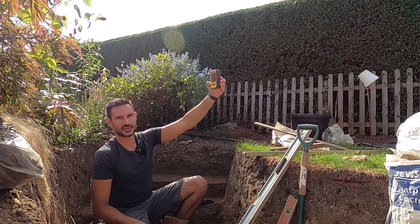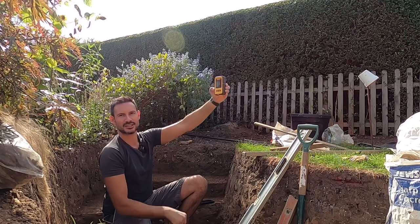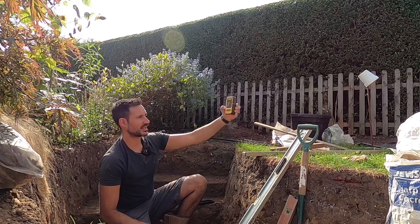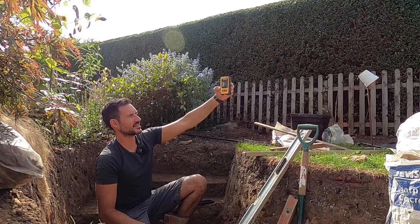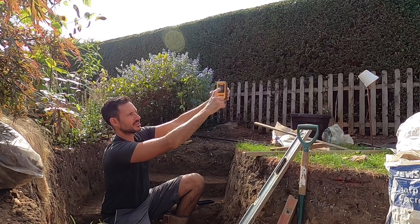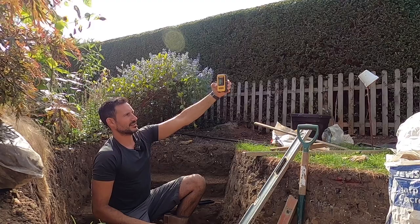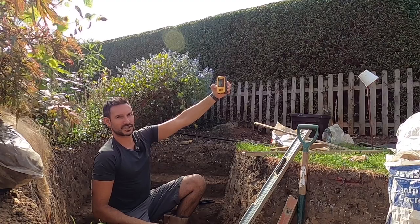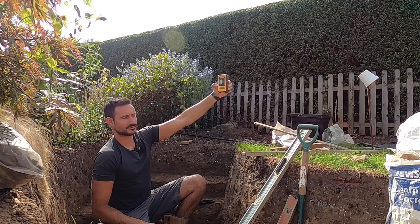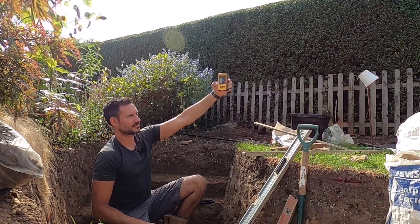Now, the tones change whether the laser is higher or lower than the central face, which is marked on this, but you've also got a handy arrow pointing up or pointing down. And once that laser is dead center to this receiver, where there is a line, you get a permanent fixed tone. There we go.